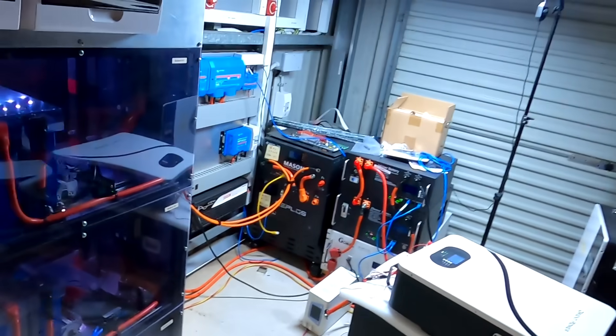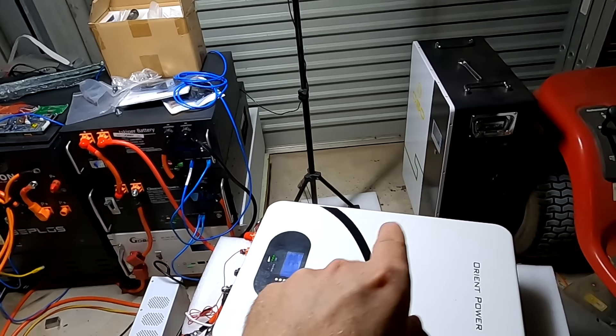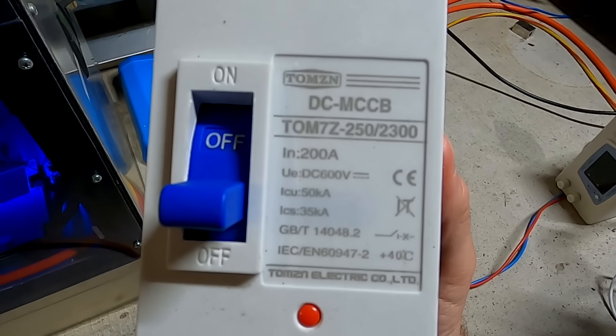As I said, it will be long evenings in the garage. We also have to turn off all three battery banks because we cannot work on these live bus bars - it's far too dangerous. I have to turn off the main breaker and then feed our main bus bar system with some spare batteries just so we can work safely, put this breaker in somehow - we'll find out. I've linked this breaker in the video description - it's super heavy, super sturdy, great specs. I also thought about using flexible bus bars - the kind used to connect battery cells - maybe two of them to connect the circuit breaker to our bus bar system.